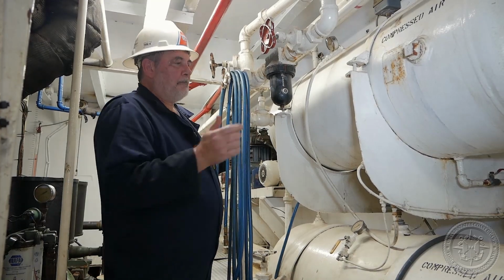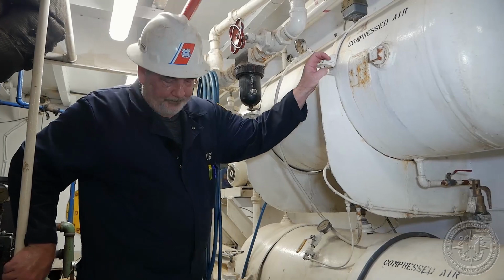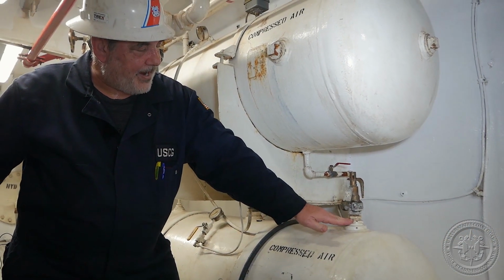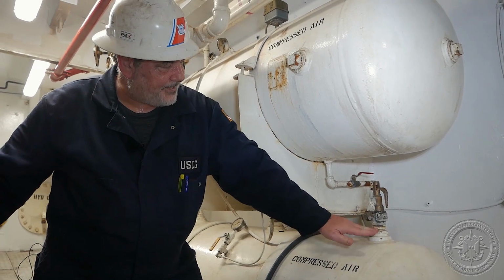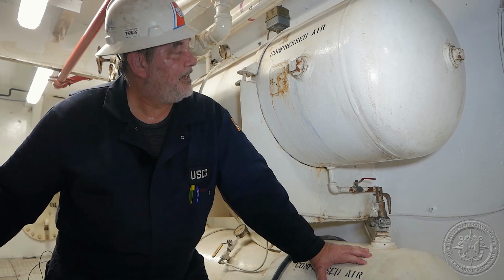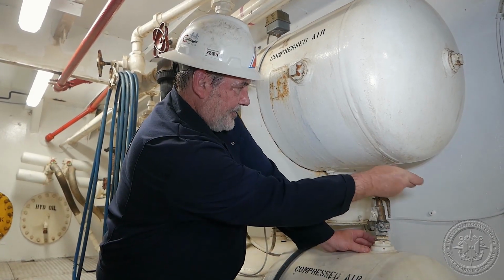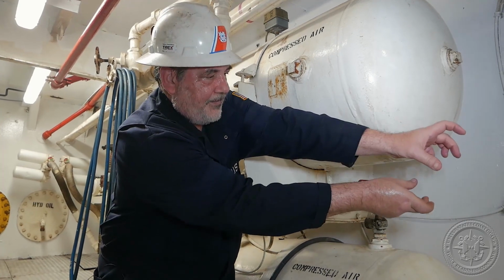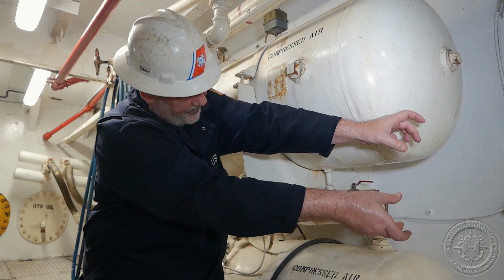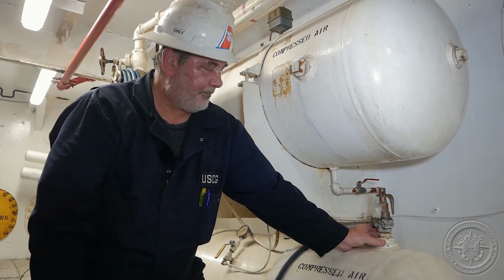Another thing to make note of on the safety relief valves is you can never have a valve that would isolate the safety valve from the pressure vessel it protects. Occasionally you may see piping connected to the pressure vessel and the safety valve connected to the piping a little bit physically away from the pressure vessel. You would never want to see a valve there.